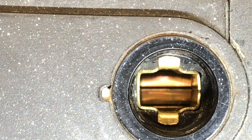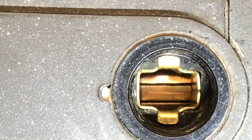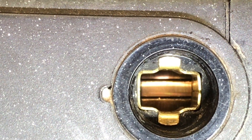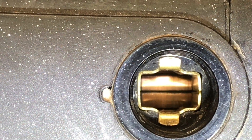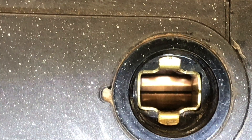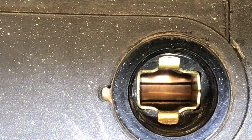It's all back together. Looking down the brush hole as we did before — I think you'd agree that's a lot, lot cleaner than it was. So I'll put both brushes in — everything else is back together. We'll fire it up and see if we've got reduced sparks. It might take a few minutes just for the brushes to bed back in because they were bedding themselves in onto the bad armature. Right — brushes in, power on, see what happens.